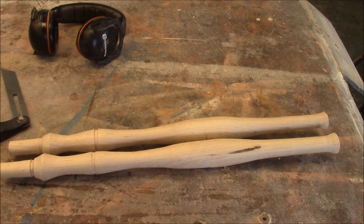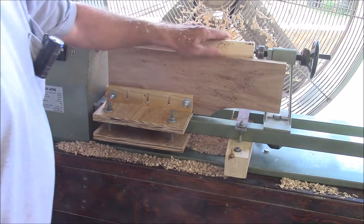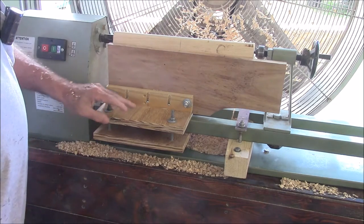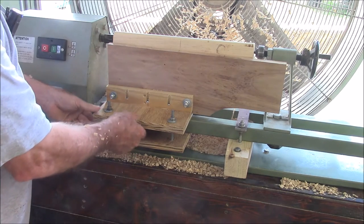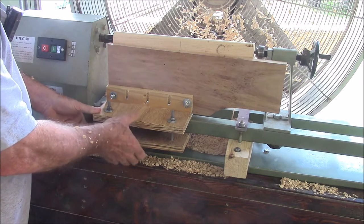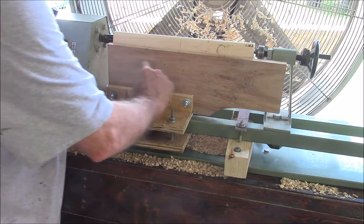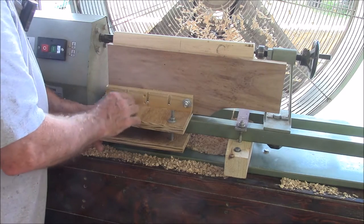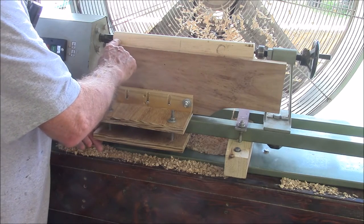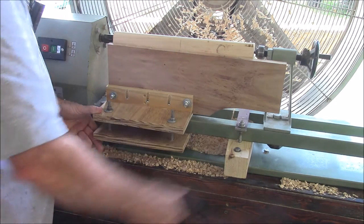We've got two legs done. Let me do the other two and we'll fit these legs on the seat. I finished the legs but I'm going to go ahead and do the stringers on the bottom too. I wanted to show you my lathe setup - this is a portable wooden rig I built that I can put a wooden tool rest in at any height or any length I want, and that's important because that way I can go the entire length of the project without moving my tool rest.